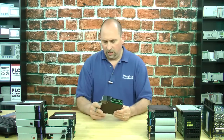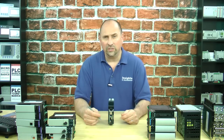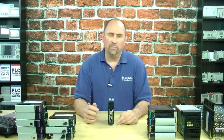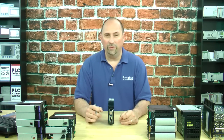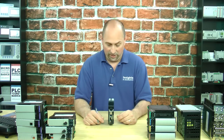That's really it for the L55, except to say that this particular line could go all the way up to version 16 of RSLogix 5000. It was also the first processor that supported redundancy — which is a really big deal. Unlike PLC-5 redundancy, the ControlLogix redundancy is very cool and easy to use, and a lot of people like this processor just for those redundant applications.